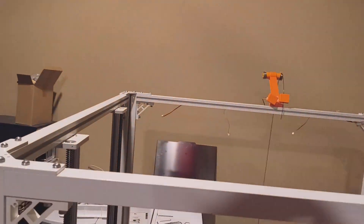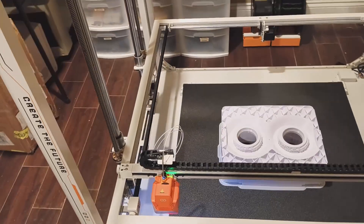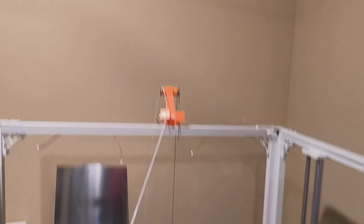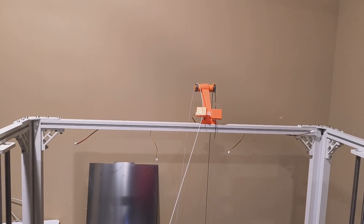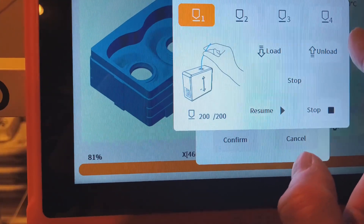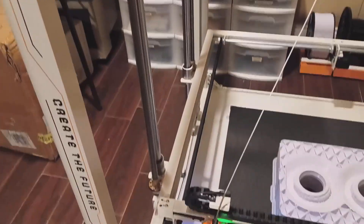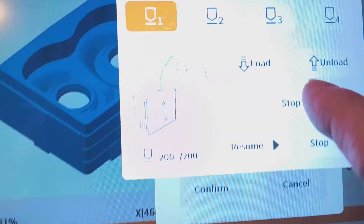The filament has run out and it's curled around the hot end. The printer wants me to insert the consumable and click to confirm. Once you've threaded the filament through the filament-out detector, you can hit continue. It will bring you to a screen where you can unload the filament - it will wind it back - or you could just press the lever and pull. Then thread the new filament back into the tube and hit Load.